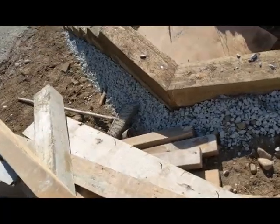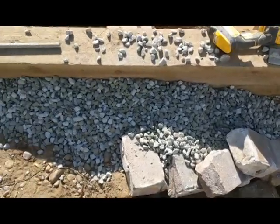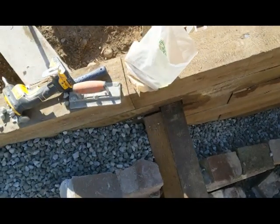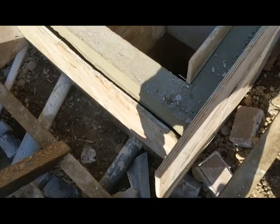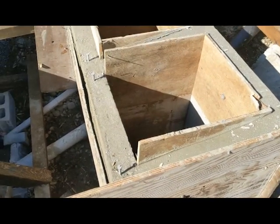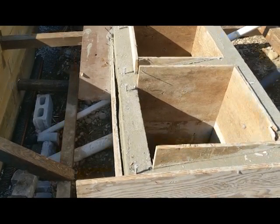Hello my friends, Bayani here — my retaining wall is up and I'm just filling back on it with gravel and starting to fill in with sand. I bring the gravel up to the top of the retaining wall. Like you guys can see, the big old pipe is there. I just put some blocks to separate the sand from the gravel. Here we just have to raise up the distribution box, that way it's gonna be the height of the paving. I just tried to remove the form but it's a bit fresh — we just done it last night and it's not enough time, so I'll give it another day and then continue the job.